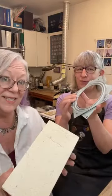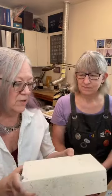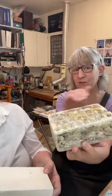One of the things a lot of people use when they're learning, in schools and things, are the kiln bricks. Kiln bricks are lightweight and very inexpensive — you can get them at any ceramic supply place. They're soft, so you can pin things into them. This is a great solder surface. It's great sitting on top of a trivet so you can spin it, because it's light enough. You can cut kiln bricks in half and get one of the small lazy Susan turntables and actually screw it right into the bottom of the solder brick. You can carve into them to make depressions, cut them with a hacksaw or bread knife very easily.